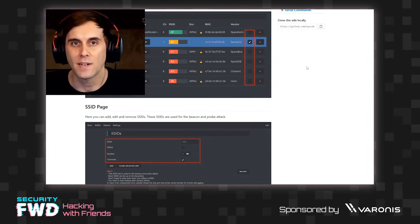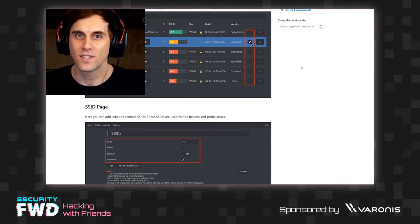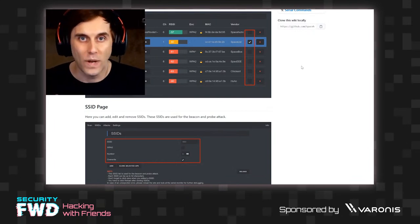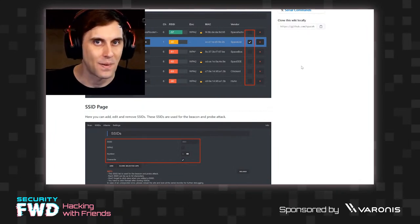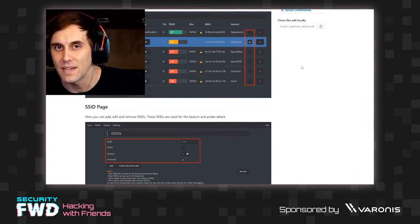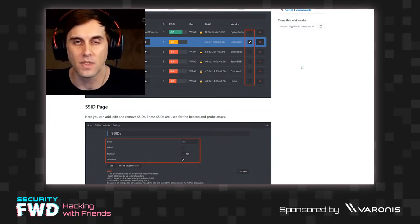So the big problem here is, if we want to do Wi-Fi hacking stuff, we need to use the radio. But if we want to access the interface and get the results of our scans back or the ability to put in a new scan, we as the hacker need to use the Wi-Fi radio as a communications platform so we can control the device. So we really have a catch-22 here. We have this great Wi-Fi radio we can do hacking with, but we've also set it up as the only way for us to interface with the device. So really, what's missing from this is an easy way of connecting to this microcontroller from another interface, some way that we can keep the Wi-Fi radio totally free to do more advanced things.